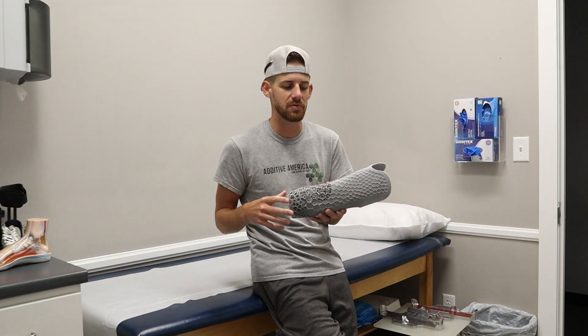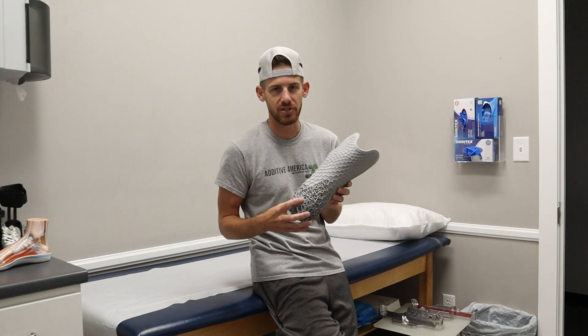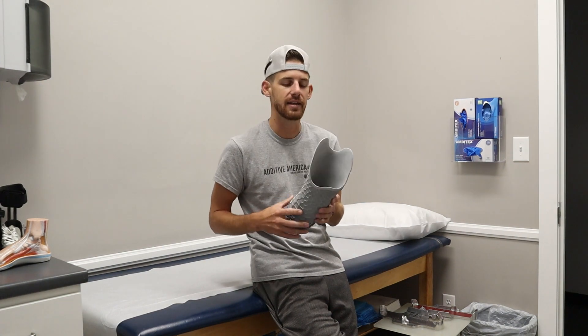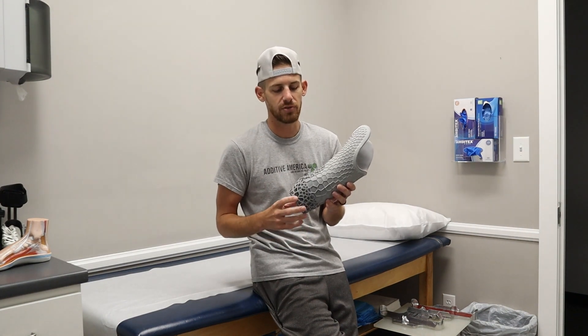Something pretty radical here that was designed by Brent Wright using a couple of softwares: Geomagic Freeform Plus and Topology. He used Geomagic Freeform Plus after getting the scan data in, and then he's able to go through and create the product, get the thicknesses where he wants them, and then takes that file into Topology where he's able to apply all these different structures to the product.